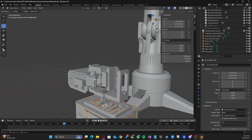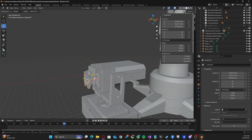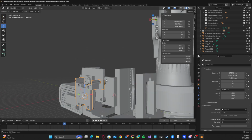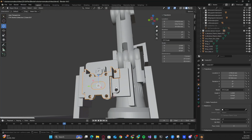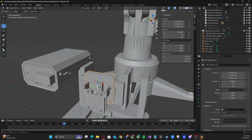For this, the only advice I have right now is to make sure the screws I used actually grip onto the holes, so it's able to firmly keep it at a distance. The reason I want you to keep it at a distance is that when this is 3D printed and you put your TOF sensor there, the TOF sensor lands on the camera part, which is right here, and it's pushing in the camera, at least for my Noir one. I don't know what this design is based off of, but I got a Raspberry Pi camera module design, so I designed it off of that. But when I fully did it physically, it was pushing in the thing.